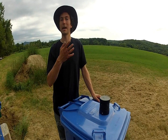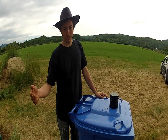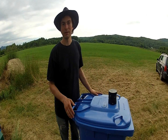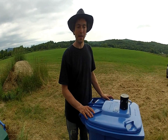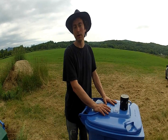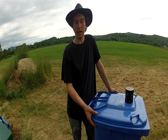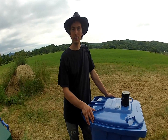The three most important things for composting are: getting excess moisture out, having wood shavings or bark mulch added regularly, and having a passage for air. Without all three of those, you don't get composting — you just get buildup. Those three things create the perfect environment for the microbes that do the decomposing. At the end of the process these bins will sit for a whole year or more, because one will be filling while the other is resting, so compost will have been maturing for an entire year before anyone has to deal with it.